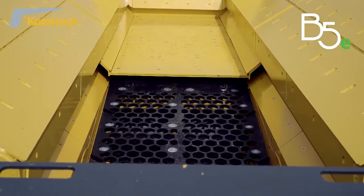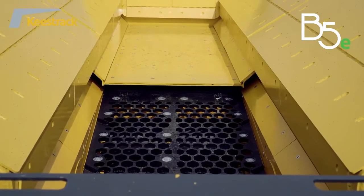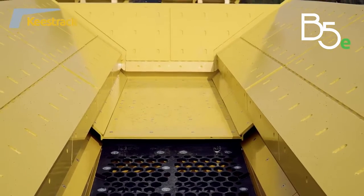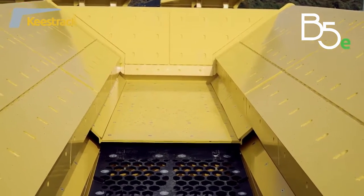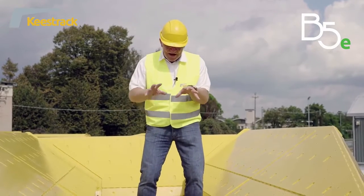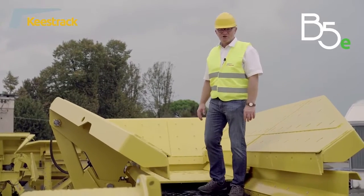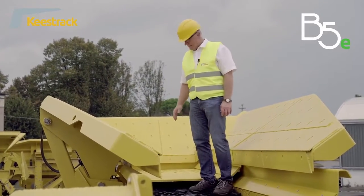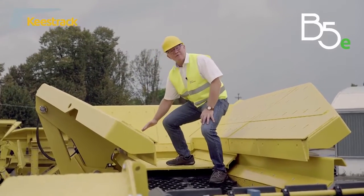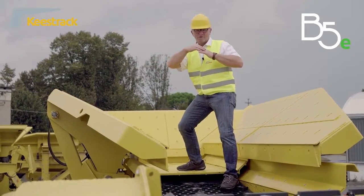scalper can be punch plates with hexagonal openings or longitudinal openings, and the change of the punch plates can be done from top. So it is not necessary to go underneath the machine. Everything can be done from top. To avoid spillage of fine and wet material in the hopper, as we have seen before, we have here a very good labyrinth sealing which is closed when the hopper wall is closed.